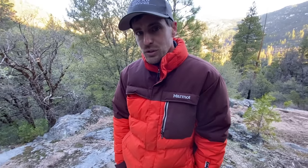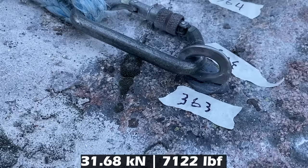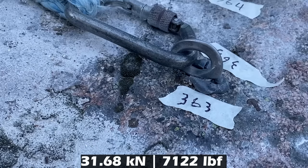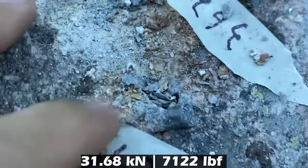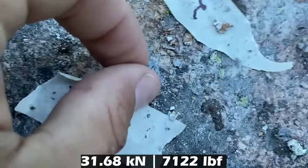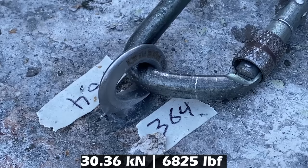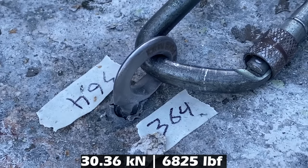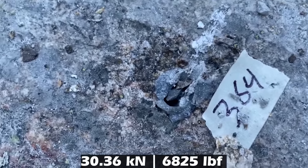Welcome to tomorrow — it's been about 16 hours and it was pretty nice yesterday, so we feel these are fully cured enough and ready to be pulled. All right, look at the glue here — it crushes it. You're pulling 31 kilonewtons against it; that's what I would expect but it didn't compromise the strength. This is one of the strongest results we've gotten with these Healy bolts. There's a bolt in there and that's pretty consistent results.